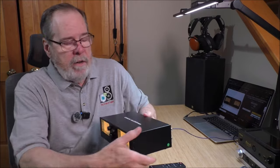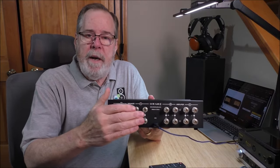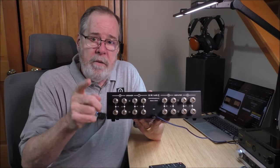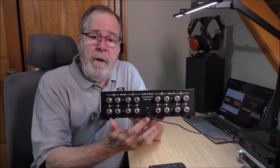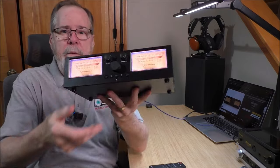On the back side, a nice improvement over the previous model is the great spacing between the banana plugs, the speaker terminals, and amplifier inputs and outputs. It does run on five volts but does not come with a power supply — you need to get a good five-volt, two-amp power supply for it to run properly, and it's USB-C in. It's a very rugged, very well-constructed unit. Let me show you a little bit closer on the VU meters.